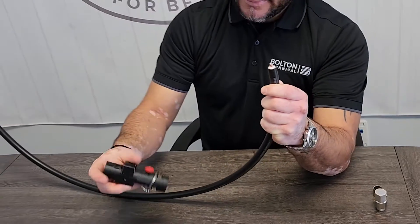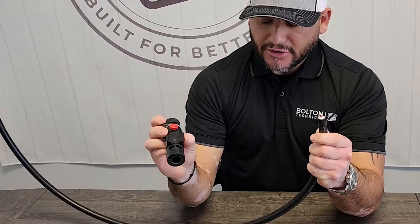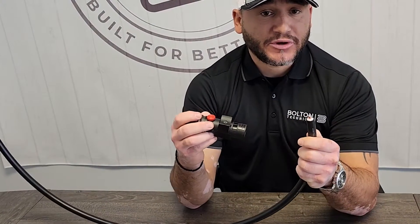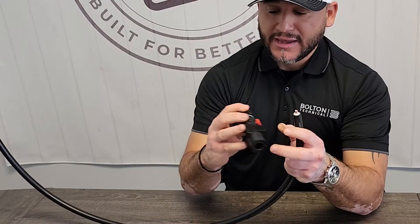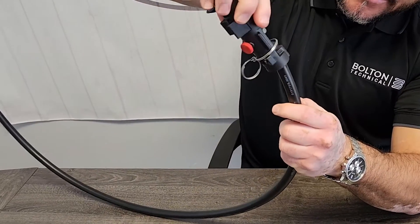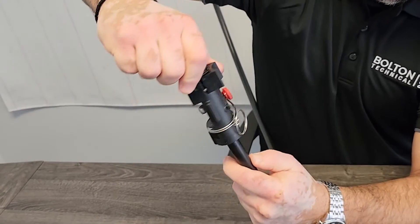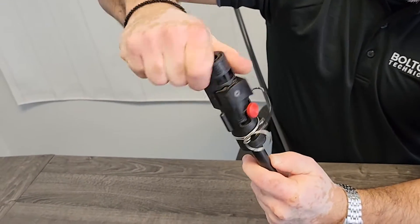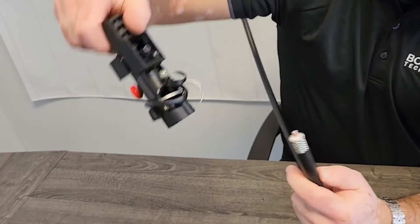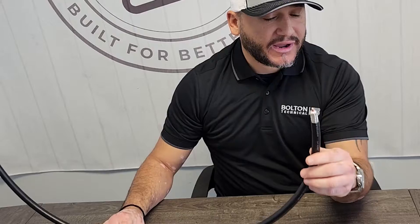There's a second process of terminating the cable. On the other side of this prep tool there is another insertion where you press down and it will cut the jacket off the LMR 600. I'll go ahead and press down, take the other side of the prep tool, press down — this right here is going to cut the jacket. As you see, as I'm turning, the jacket is becoming stripped. That is a correct prep for the LMR 600 and the connector.